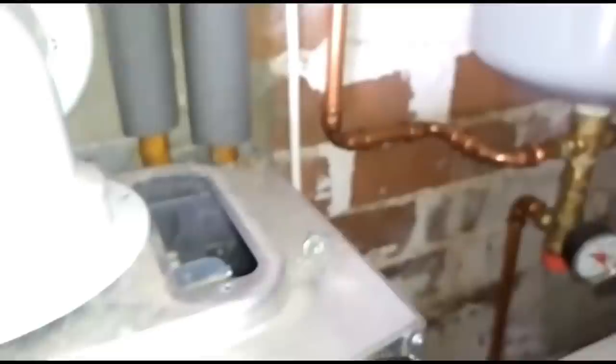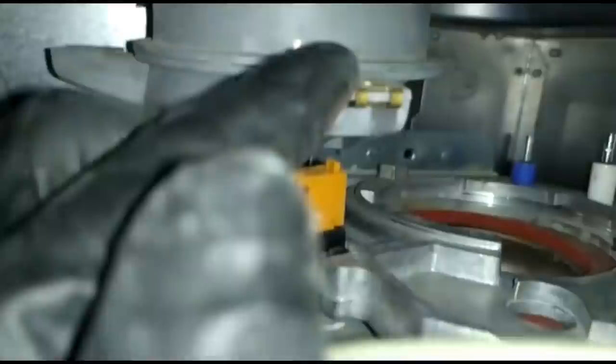Sorry about that, people always phoning up. Two screws in at the front as they are, but on the back, the screw is in, but it was doing nothing. And when you look inside, you have the little clips here, and that's the rear one, doesn't have one in. Carry a pack on board, because I see this all the time. There's the part number, 87106090150, or you can just get a box of whatever, multi ones, but I just grab the ones from Worcester, it's just easier, and slip it on, job done.